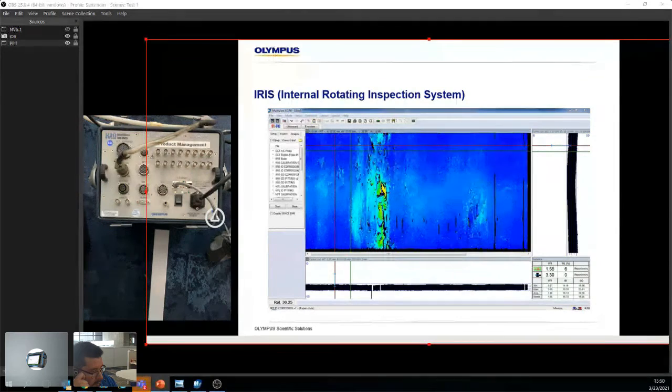I believe so. So next question we have here, we have a couple for you. Yeah, go for it. A U-bend, what type of probe can be used for this inspection, and what is the probability of detection? Okay. So in U-bends, we have the TEG probes. Anything that's TE is usually associated with eddy current. So we have TEG probes, which are for eddy current. Detection is pretty much about almost the same.